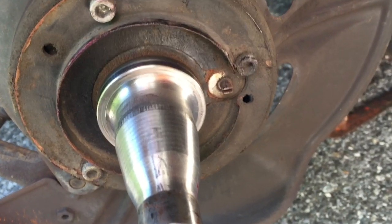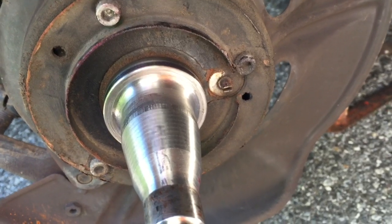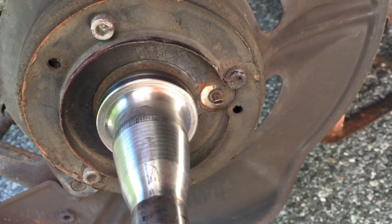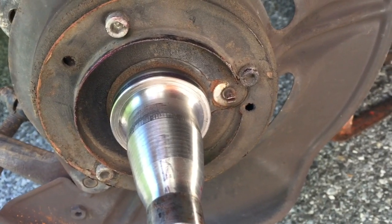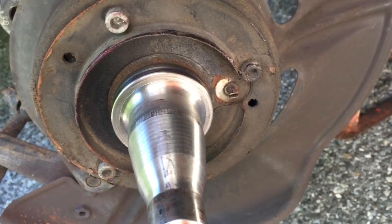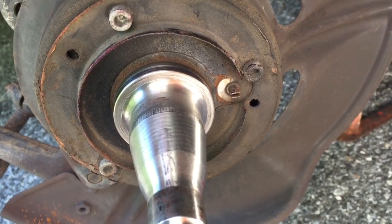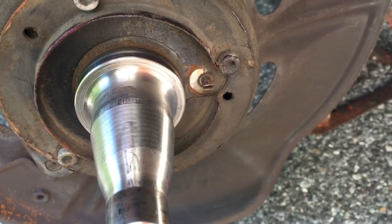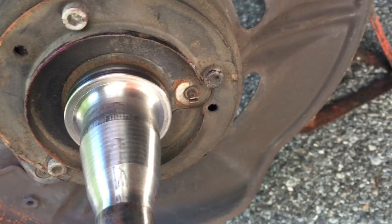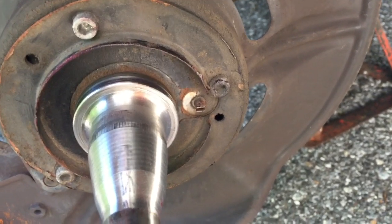You don't have to take the wheel off to get to it, however sometimes they get stuck in the bore because of rust or something else and you have to drive them out. You have to do that really carefully using a socket wrench because the innards get damaged really easily, and then you'll never get rid of your ABS light coming on and the brakes pulsing.